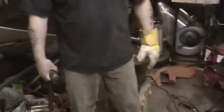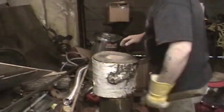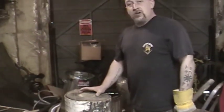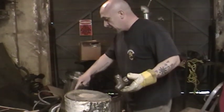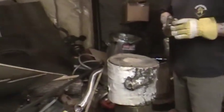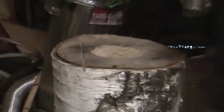For the purposes of today I'm going to use this steel dishing tool that I made, but normally guys use just a wooden dishing stump. It's about a four-inch diameter, about an inch and a half to two inches deep. This ridge here — we'll show how to use that and what you're going to use it for in the next installment.